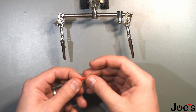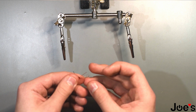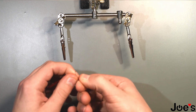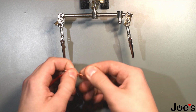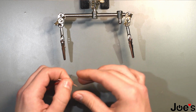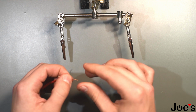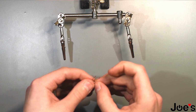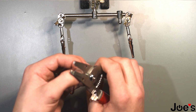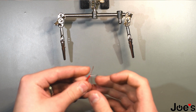And so what you do is the red and gold wire and the green and gold wire and the gold one, you put all together. Nice. Start rolling them up like so for good connectivity. Go ahead and strip the mic wire, because it's not stripped yet.